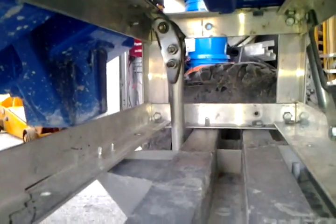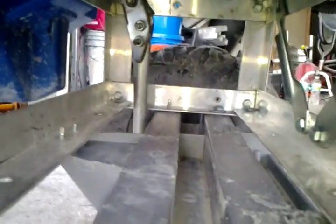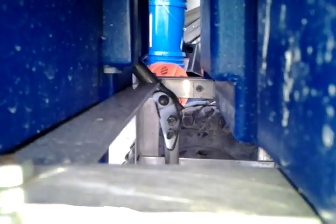and then my steering's kind of weird. It's not what I'm sticking with right now, but I'm gonna make something different. All I did was create a piece, almost like a knuckle, bring it down, and it just dropped straight down where the stock one would go in. Now the steering is harder because of this, because it's going straight down after coming out of your steering wheel.